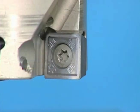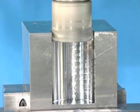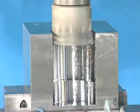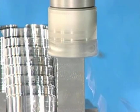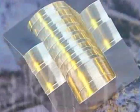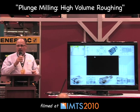This is one of many cutting tools in the Ingersoll line for effective plunge milling operations — it's actually a drill insert and a plunge mill body. Now imagine if this workpiece were laid on its side in a vise and you were coming through with a zero degree lead tool trying to channel it out — there's no way you'd remove that many cubic inches in as short a period of time. Now, if you listen as it retracts, there is no pull-off. What we want you to do is come straight down, then skew off about two degrees, change vector, and go straight up. Most programming software will do this for you automatically. If you're doing point to point, make sure you take that into account.